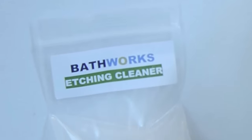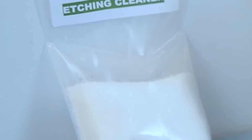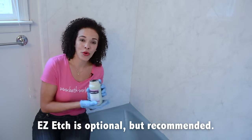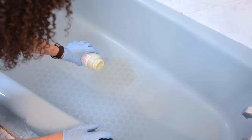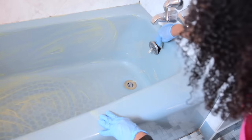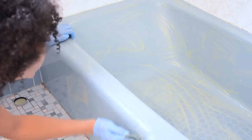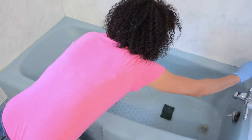There's one more cleaning step: scrub the bathtub thoroughly with the Scotch-Brite pad using the etching cleaner provided with warm water. The Easy Etch will create an undeniable bond between the refinishing kit and the tub. Use it only on porcelain, glass, or ceramics — not on fiberglass, plastic, or acrylics. Spread the Easy Etch paste over the entire surface with the Scotch-Brite pad, paying particular attention to the drain and front. For a colored tub like this one, leave it on 30 to 40 minutes, then rinse really well.